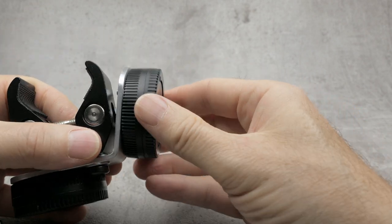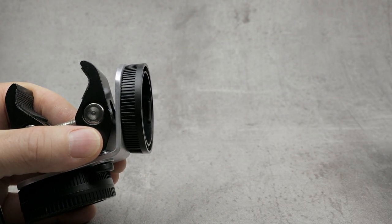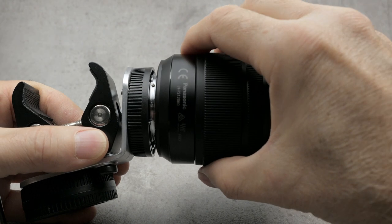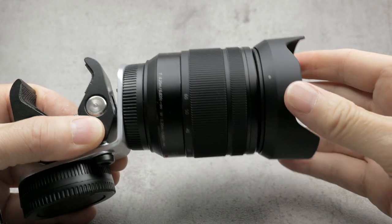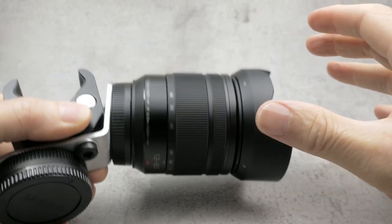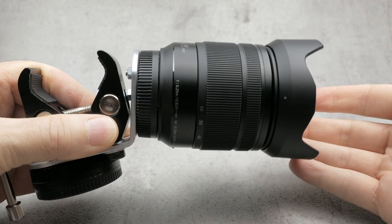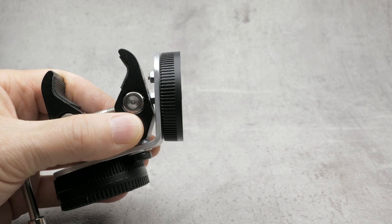The cover is just a body cap. The lens fits firmly on these particular caps, but I did have to remove some excess plastic that got in the way. I used two bolts to stop the cap from rotating and countersunk them to prevent damage to the lens.